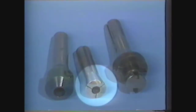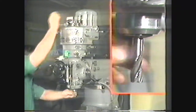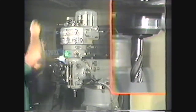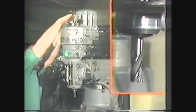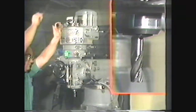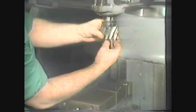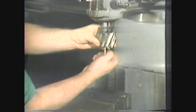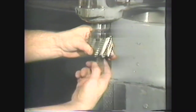The split collet holds and drives the cutter by squeezing the tool shank. The collet is closed around the shank with a draw bar which pulls it into the taper of the spindle. The split collet must be used with caution since a heavy feed rate or dull tool will tend to pull the tool out of the collet. This type of collet holds the shell-type end mill; the shell fits on the arbor of the collet and a large screw on the end of the collet holds it in place. This device uses a key to drive the cutter.